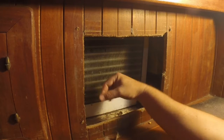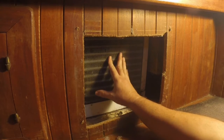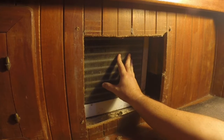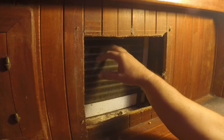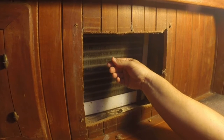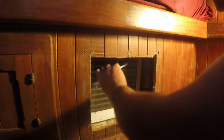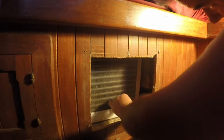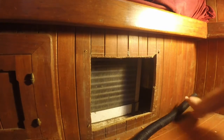It will not cool as well if those fins are bent. The other thing I'm noticing is it's a little bit damp — it still has a bit of condensation on it. That means it's not going to clean quite as easily. So what I'll do on this one is hold the vacuum below and use a small brush and brush this down. I do expect with this one I'll end up getting a little bit of a muddy consistency on the brush. We just want to brush this very gently with the fins, loosening up any of that stuff right on the edge. It tends to cake up right near the very top where there's a gap in the filter.